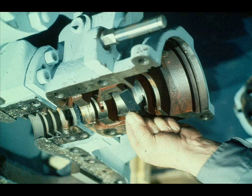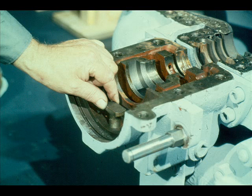It's a good idea to reinstall the leaf spring first, to preclude the possibility of forgetting it later. The spring is placed in the bottom of the rotor-locating bearing fit of the case, as shown here. Now place the overspeed trip plunger back into its fit.